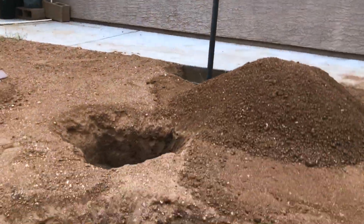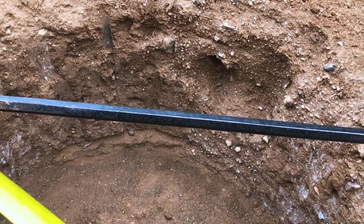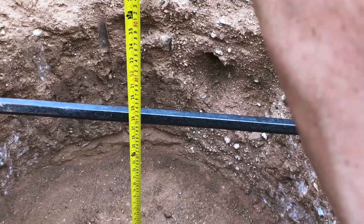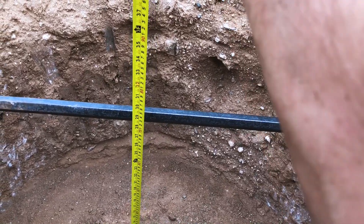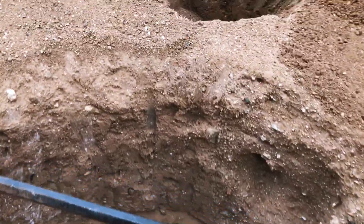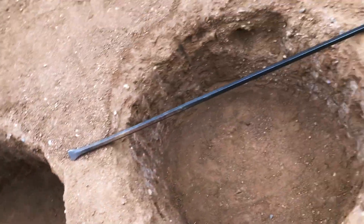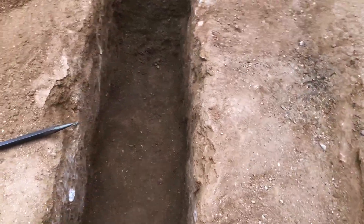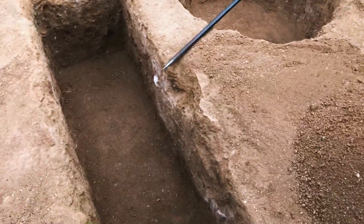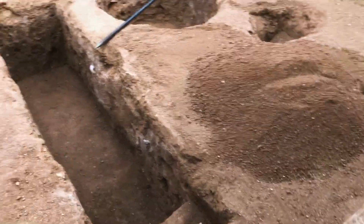I'll show you how I measure this — it's pretty crude but you take a bar, run it straight across, and run the measuring tape straight down. This is showing about 28 inches down. With that I did the math: if I've got 28 inches down and four feet across for the circles, and the rectangle is about five feet long, two feet wide, and again 28 inches down — all of that put together means I should need about three cubic yards.